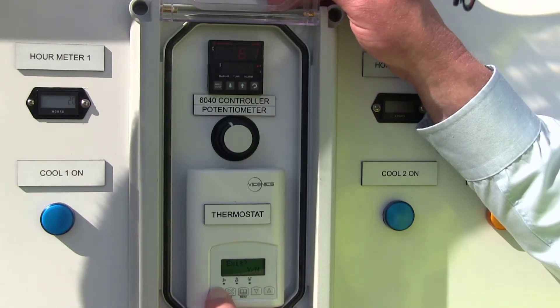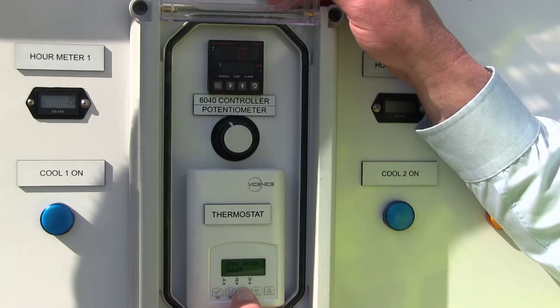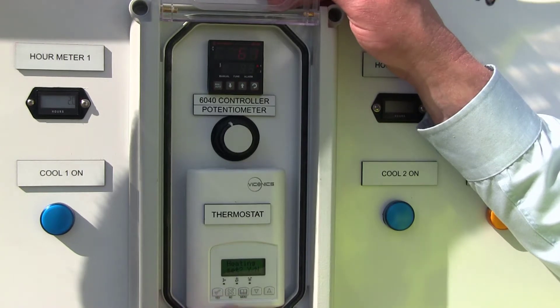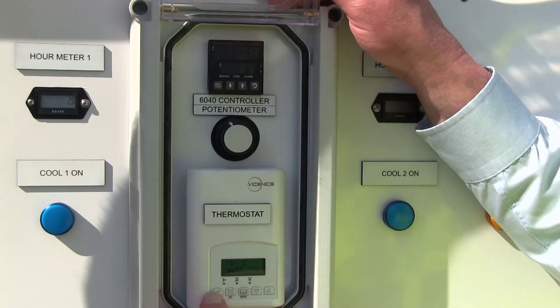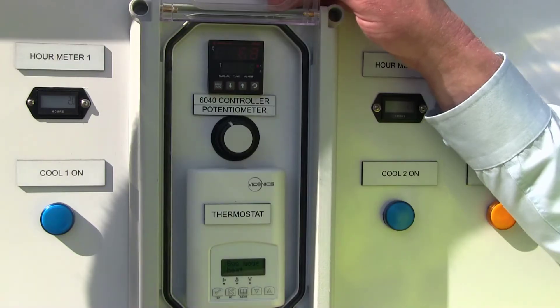Now the room temperature is 78 degrees. To change the temperature, push the menu button. When prompted for temperature set point, select yes. When prompted for cooling set point, select no. Select yes for heating — it's set at 68 degrees. You can hold the button for rapid change or push it individually. Set it to 90 degrees and say yes. For Fahrenheit/Celsius, say no. Select exit. Now the room temperature is 77.5 and we've set it for 90 degrees — the heating is engaging.